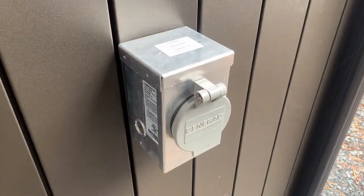So don't do it — don't back-feed. We don't recommend it at all. The proper way to do it is to use a generator panel like you see behind me here in this video. In other videos we'll demonstrate how the equipment works, but this one is just a short video about the generator panel and the equipment itself.